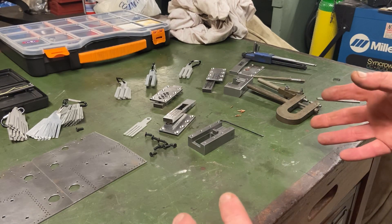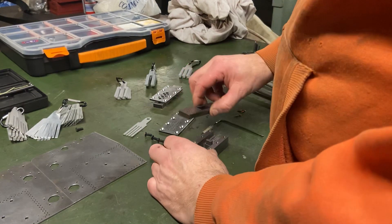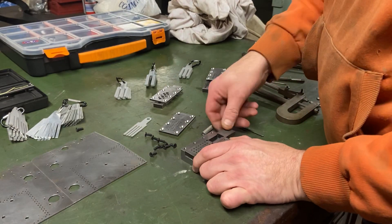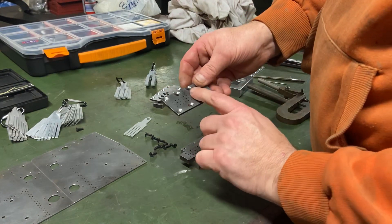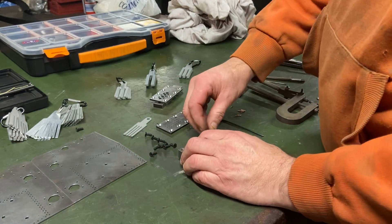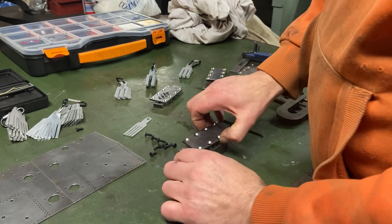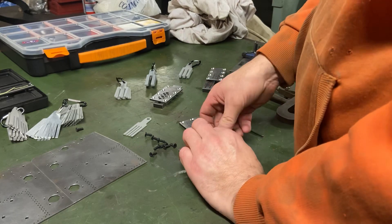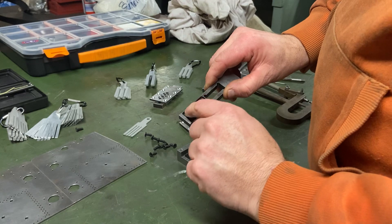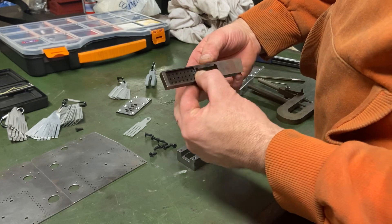So this is what I'm going to talk about cutting down today. The tool I've made is like a guillotine where the blade slides backwards and forwards. This is the cutting blade and this is the top plate that the rivets fit through, which is an eighth of an inch thick. I've made it so a return spring can fit inside, and these holes correspond with these holes here.